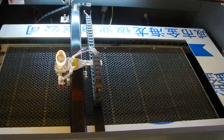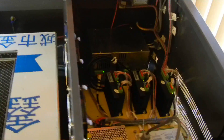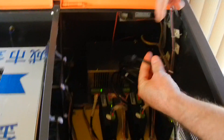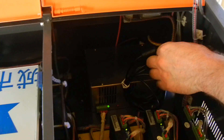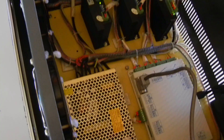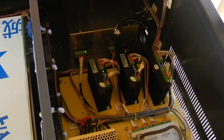Here's the engraving area with the electronics compartment. When you get this, basically this is your USB cable and there's a hole down there — you can run the USB cable out to your computer's USB port. Before you turn it on, just make sure all these things are plugged in good around the boards, everything is plugged in nice and straight, nothing is loose, no loose wires.